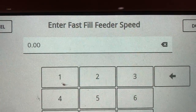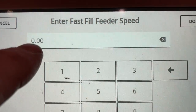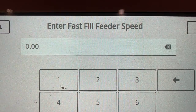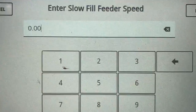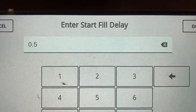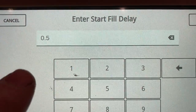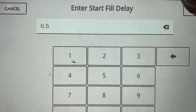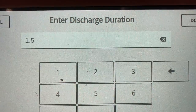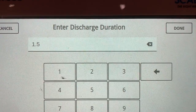For a vibratory scale, this is the vibrator speed. We could set it at 50% for fast and 50% for slow — that would be fine. There's the slow vibrator speed. The start delay is the time to let the weigh hopper doors close before it starts to feed — this could probably be down at 0.2 seconds. This is the dump time: 1.5 seconds is typical.